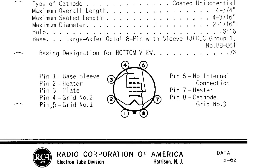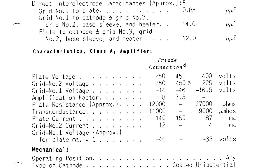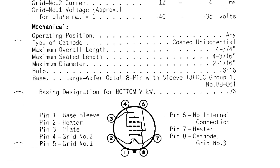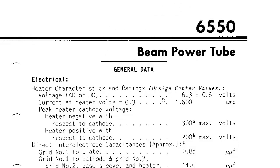Pin 5 is the control grid and pin 4 is the output screen. As you can see, this tube operates normally under about 450 volts for a 7.5 amplification factor. The control grid is at negative 46 volts, which is quite common — normally the control grid does have either a negative or zero volt bias. As you increase it toward more positive volts, it lets more current flow through to the anode. The filament voltage is always low — 6.3 volts.